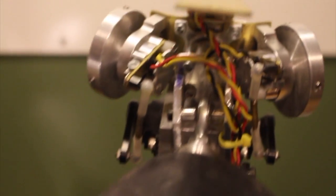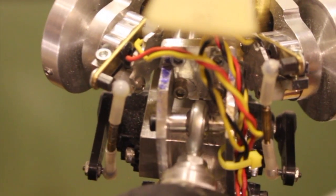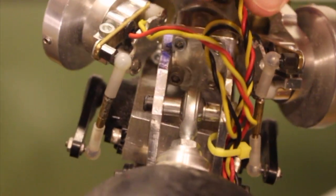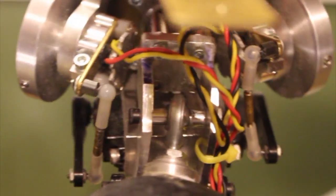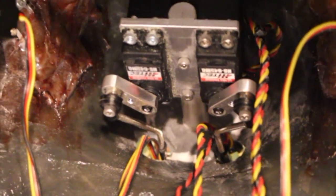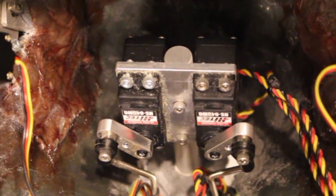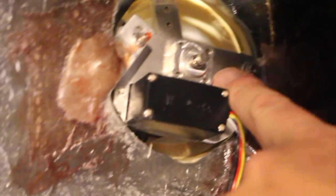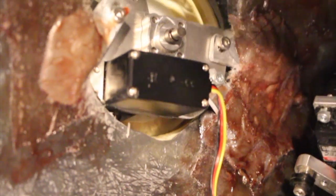On the back side of the head is where you find the swivel bearing, which allows the head to move up and down and left and right inside the helmet. Inside the helmet you can see there are two servos with two machined aluminum arms — also Actobotics Servo City parts. And here you can see the Actobotics piece used to mount the pivot for the fan.